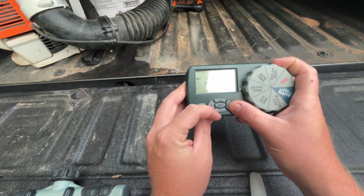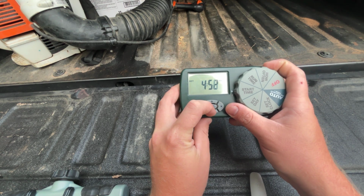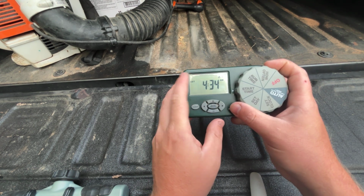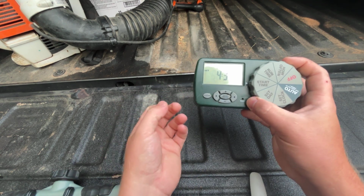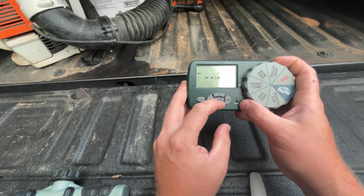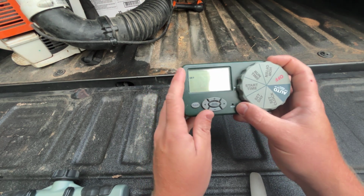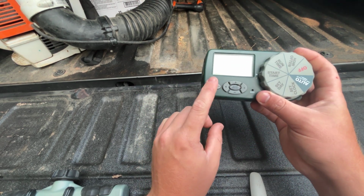at 5 a.m. If you want to run a second cycle the same day, you click over here and go over to cycle B, and you adjust the time accordingly, AM, PM, however many hours you want apart. And the same thing is for a third cycle in one day. You will hit this arrow button here and go over to cycle C and program the specific time that you want. And you do not need to hit enter or anything. Once you select these times, they automatically save, and to clear them, you hit this clear button.